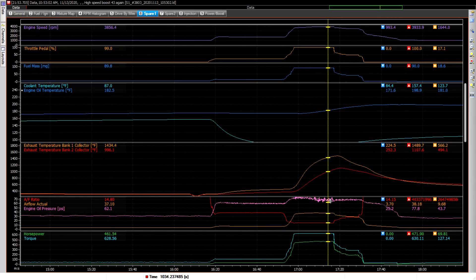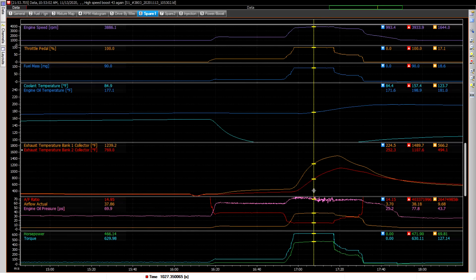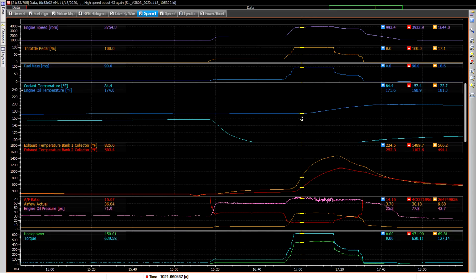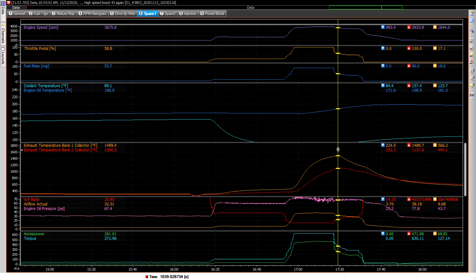You can see the pink line at the bottom starting to jump around - that's the oil pressure. When it really starts jumping around, that's the governor kicking in because it's drawing more oil from the engine as it sends oil pressure to the prop. The oil temp went from 174 and ended up around 198, which is not bad for just a short run. The exhaust gas temperature - or turbine inlet temperature - was 1,487°F, which is reasonable and in line with what I've seen before.